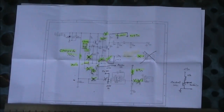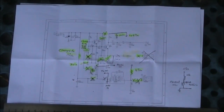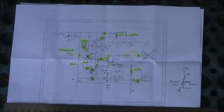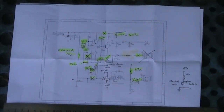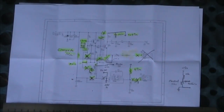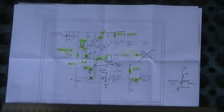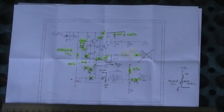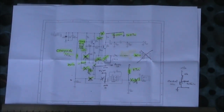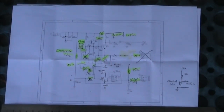This has been a Pixi challenge. It sounds harder than it is, and I'd suggest you refer to the circuits again to show the difference between the Pixi as an AM transmitter and the Pixi as a CW transceiver. The AM transmitter is actually simpler, using fewer parts than the CW transceiver. It's only a couple of hundred milliwatts, and I wouldn't regard it as a serious project. It's very unlikely that you'll get replies to CQ calls at all.